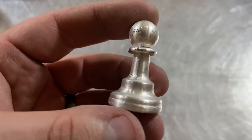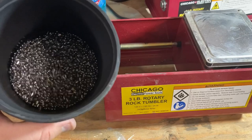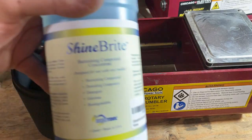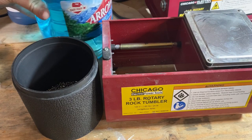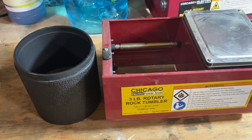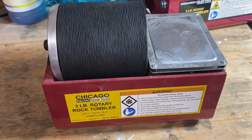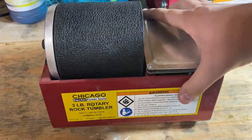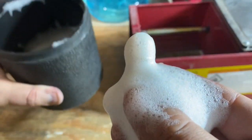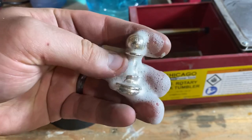After a few minutes with the steel wool, we're ready for the tumbler. I am loving the final product. For tumbling, I use stainless steel shot — you can use other mediums, but that's my favorite. We'll go ahead and pop the chess piece in. Shine Bright solution is my favorite compound to get that nice finish — add a little water, just a little bit over the top of the media, then put the lid on and begin tumbling. I used to tumble anywhere from 1 to 12 hours, but I realized you really only need about half an hour. Once we take the top off, it's super soapy, but here is the final chess piece in all its glory — that is looking absolutely gorgeous.